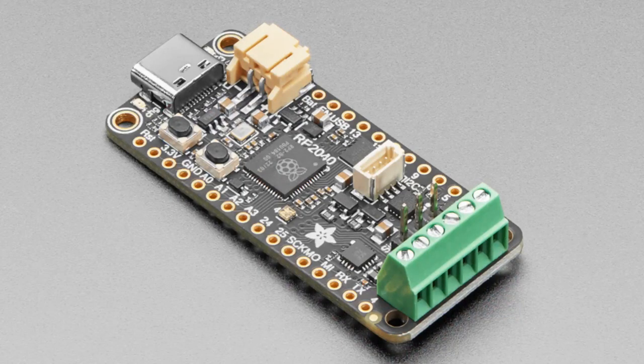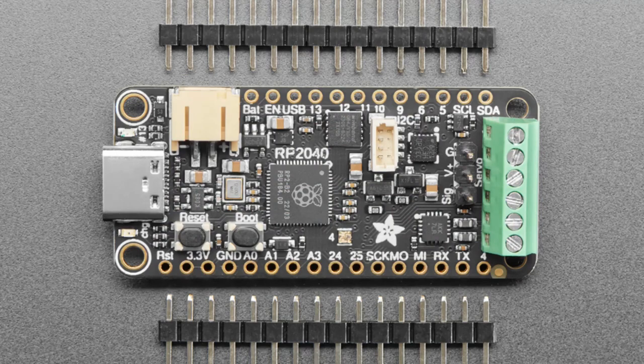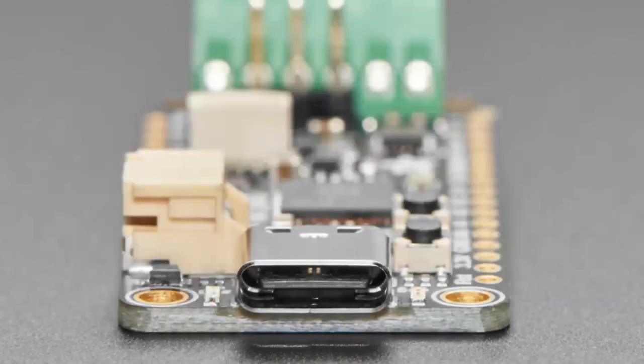And I think Phil B was the one who was like, can you stick a servo connection there? I don't know. Somebody said so, and I was like, yeah, it's a good idea. So I did, so you can plug and play a servo inside. And then there's terminal blocks for the outputs. So the NeoPixels, a button input, and the speaker output all have terminal blocks, so you can really quickly wire up a project. There's probably a lot of projects you can do with minimal soldering, and you don't have to solder to the feather itself. You just use a terminal block.